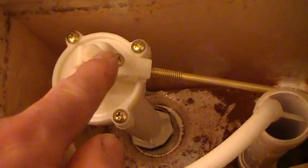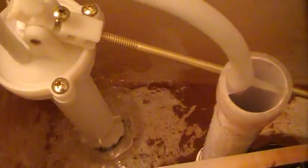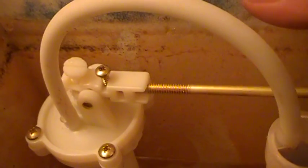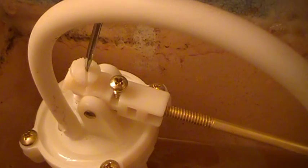On top here there are two screws on top of the ballcock. Let's turn the water on and see what happens. You can see how far this is down here. This screw here adjusts the level of the rod drop down. You actually want to turn that down so it doesn't interfere with the flapper. And this one adjusts the height of the water.